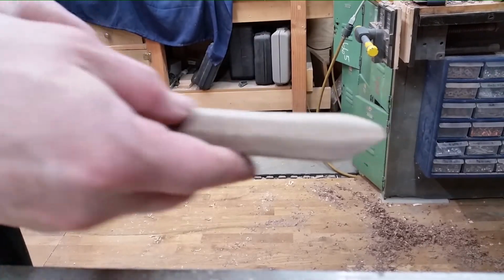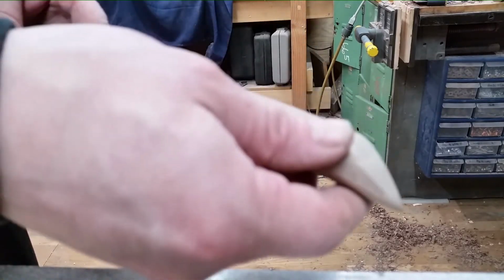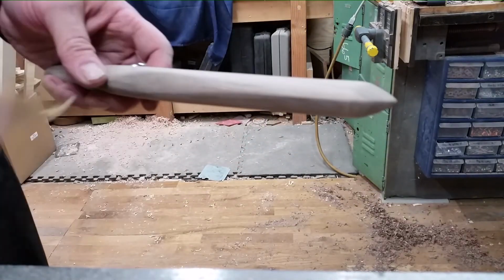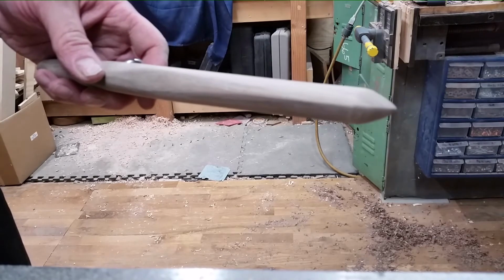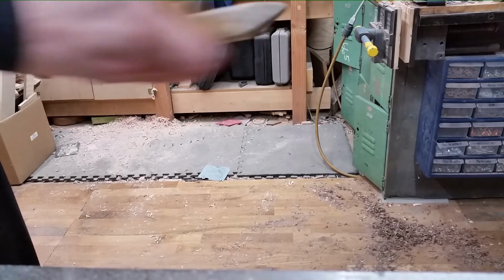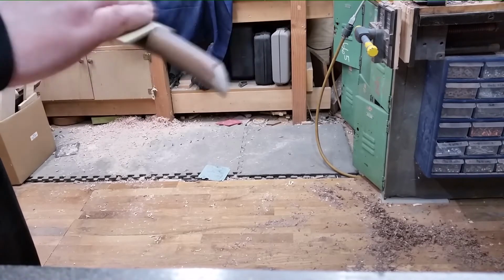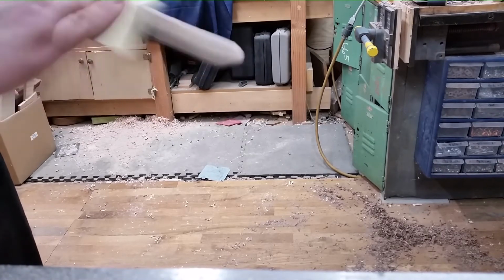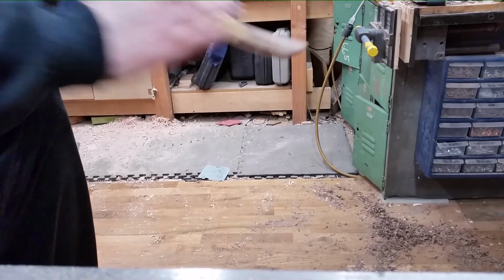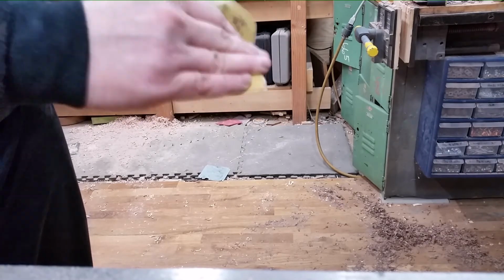All right, so first round of sanding with the 320 is done. It's in pretty good shape now. Now we can move on to wet sanding. I'm not sure how the Gator holds up doing wet sanding. Some papers are better than others. Some are made specifically for wet sanding, where you can sand with it wet. It creates a little slurry on the surface of the sandpaper grit that comes off, and the wood fibers that help kind of burnish the edge or the surface.